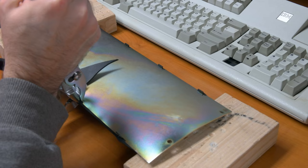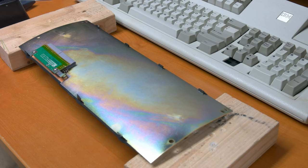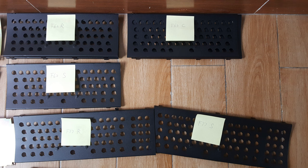You can also change cases to change from the larger case to the smaller case or vice versa. You would remove the keys, open up the keyboard case and bottom inner assembly while keeping the keyboard upside down, and then switch to the alternative bottom inner assembly metal plate. Unfortunately, you can't change the HHKB style split right shift to the standard right shift or vice versa unless you purchase another PCB, top inner assembly, and inner foam, as the keys are in a slightly different physical location.